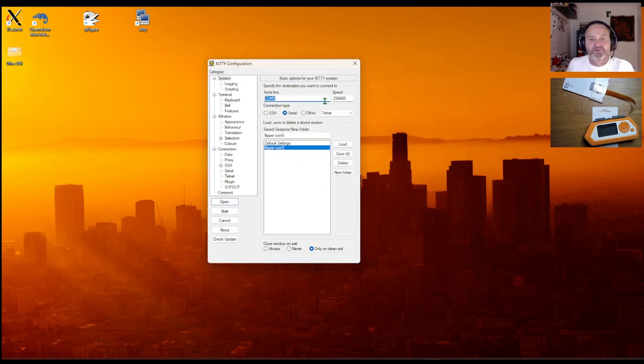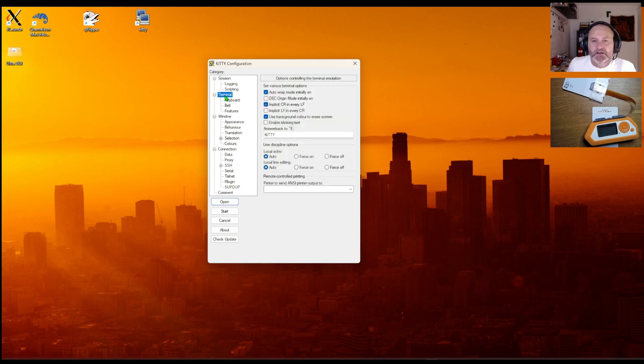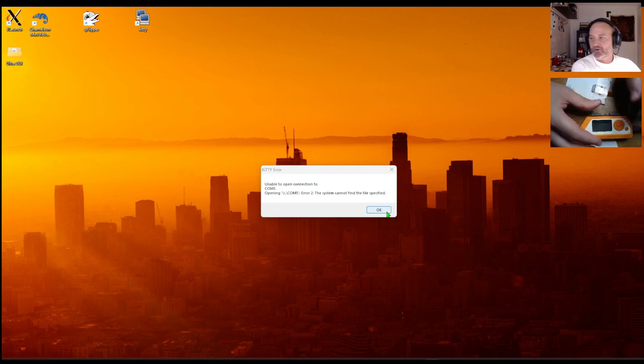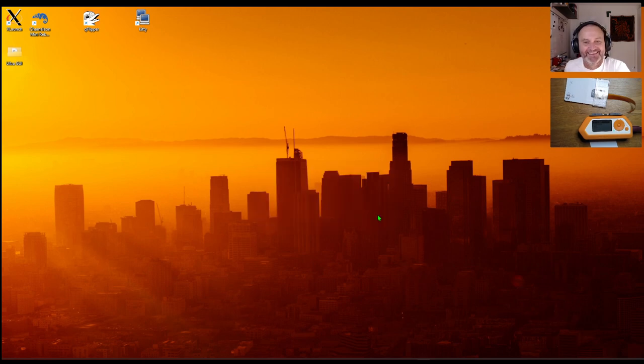So remember it was COM port 5. You take a speed of 230,400, and it's 8N1, I think it is. And you head into the terminal here if you have Kitty or Putty, and you press this one. And that's the only one you need. And then you go for open. Right. Well, it helps if your device is connected with USB. Let's do that one more time, shall we?